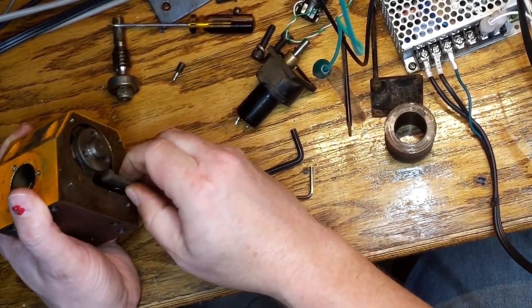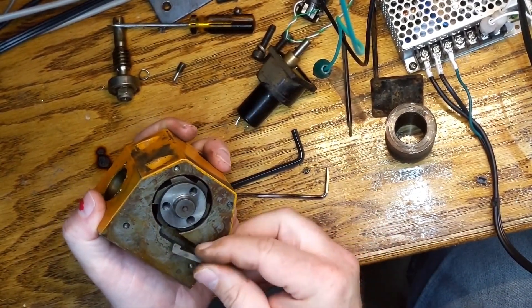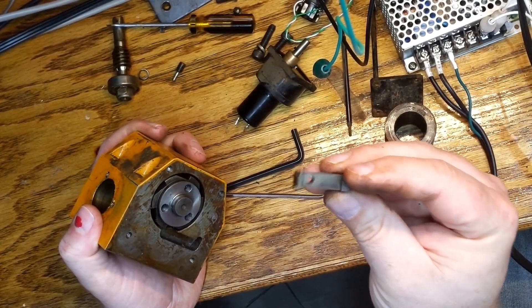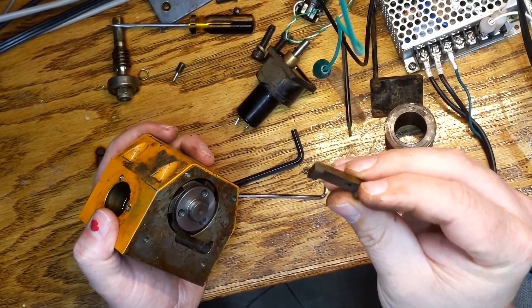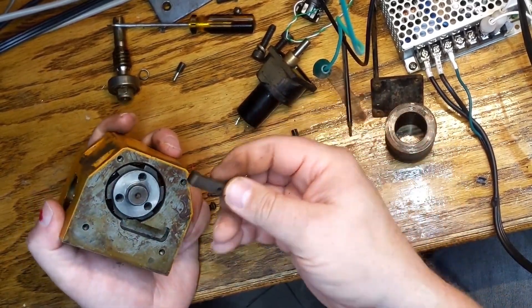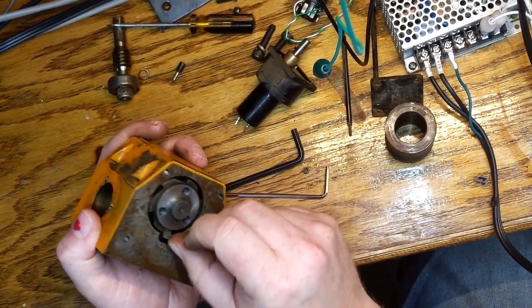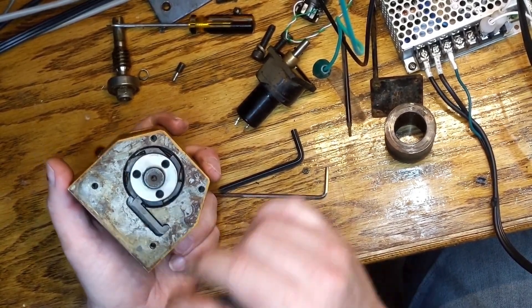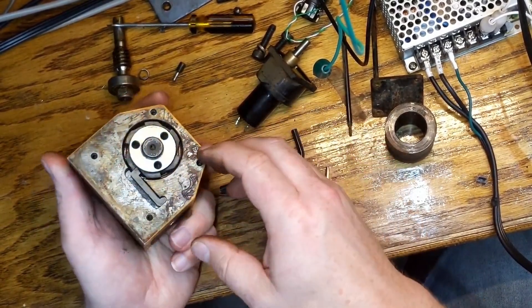It's pre-loaded with a little spring. I think it's just a piece of flat stock tin that usually goes in here, but somebody made a very complicated pawl for it and then hardened it — which I don't think it really needs to be. Like I say, I think I'd make another one and run a decent-sized set screw through here to be able to slightly adjust where center is, and that would solve a lot of problems.